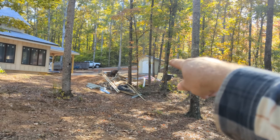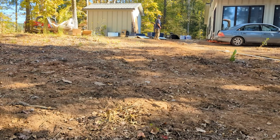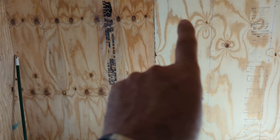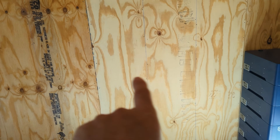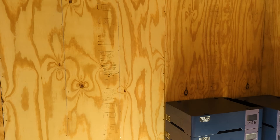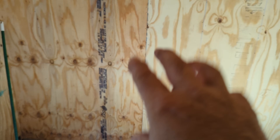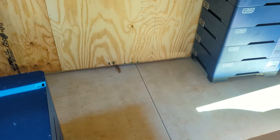I'm going to remove some concrete and then look at the mechanical room. Our final destination: inverters, a room for a second inverter, a 200-amp panel, back-to-back wiring troughs. The bypass and generator hookup will be outside. Three stacks — 30 kilowatt hours each — gives us 90 kilowatt hours of the Rubix Giga batteries. Making sure everything fits, we'll combine them into one wiring trough and pipe that into a five-foot wiring trough that'll have the inverter and panel on it. The goal of the Giga stacks was to have a battery that didn't need a rack — it's on good casters, which makes life much easier with that much weight.